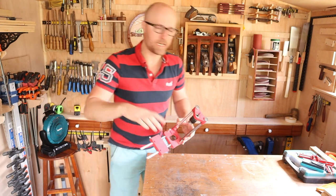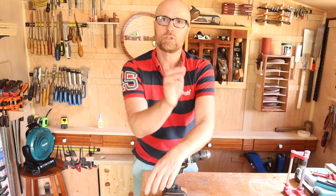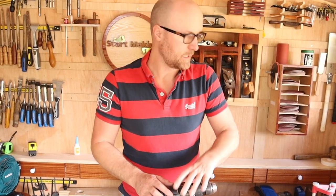There was one other really good bit of advice: why don't you practice? I've got a drill, I've got drill bits, and I've got loads of scrap wood. The one thing I never thought of doing was actually perfecting how I do it without any guides. Why rely on a jig? In a pinch, if all you have is a drill and you don't want to spend money on expensive drill guides, why not practice? Drill a hundred holes. Get a dodgy bit of scrap wood, drill them, put a dowel in, measure the angle, and see how far you are off 90 degrees. If you do anything enough times, you will improve. So if you've got time as opposed to a budget to buy a fancy drill press, what a great idea.